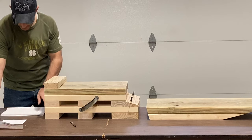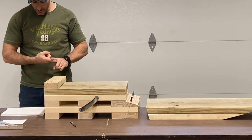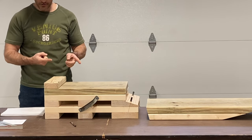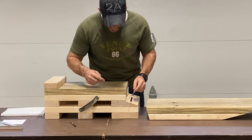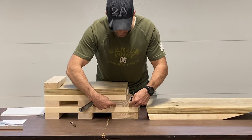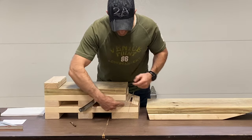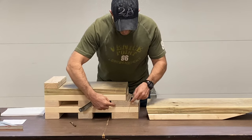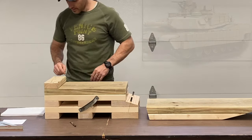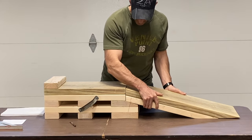And like I said, I'll put that down in the description, along with how many 2x4s you're gonna need and how many 2x8s you're gonna need, unless you change that to a 2x6, which would maybe be a little cheaper. Or I think you could even make these like 2x4s here and 2 2x4s here. I don't know, definitely down here 2 2x4s would probably be fine. Up here, I kinda like that being connected together, but I'm sure it would be okay. Because I glued and screwed all this stuff together, I think it would hold a tank, really. All right, let me try to go over how I did some of these cuts.